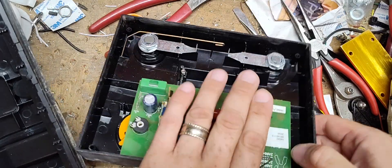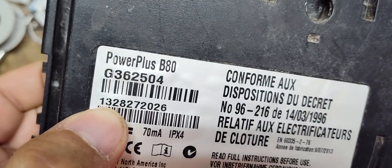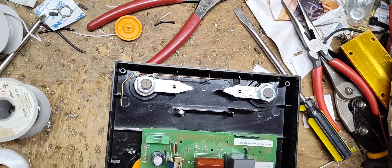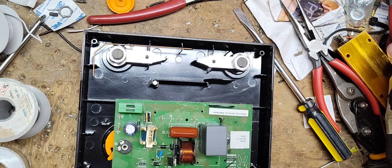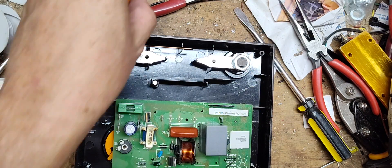This is a Gallagher B80 — they also made a B180 and a B280 back in the day. This unit is a 2013 model; the first two digits are the year it was built, so it's 11 years old from manufacture date. They came out with this model in 2005, so by the time the customer got it, it was already about an 8-year-old production run. They stopped production around 2017-18. I have a new board in stock — it's a 2018 board, new but about 5 years old — and I put that in with the transformer and it works.